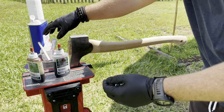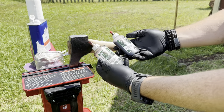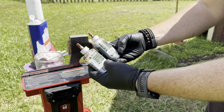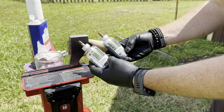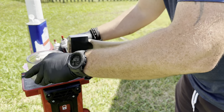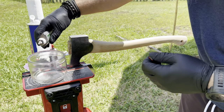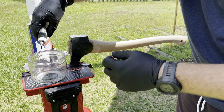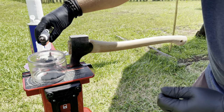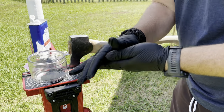What we're going to do is mix up our dye. I've chosen brown mahogany and red mahogany. I want it more brown than red, with some red undertones. So we're going to start with the base — whatever you're going to use the most of. We're going to put a lot of the brown mahogany in there, and then we're going to throw in about a quarter to half of what I used on the brown for the red.